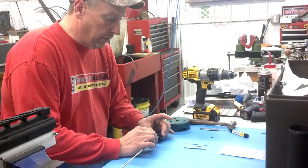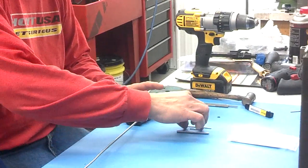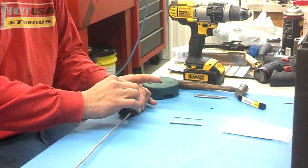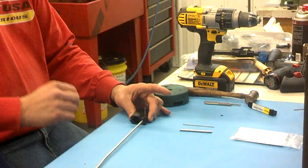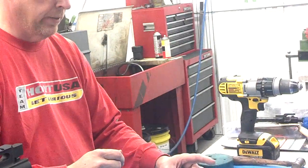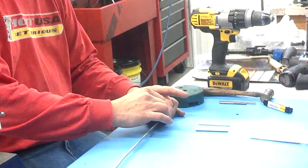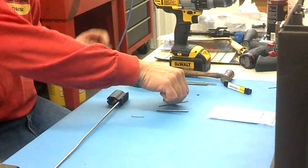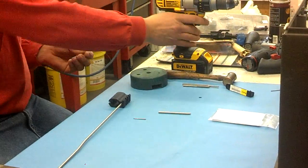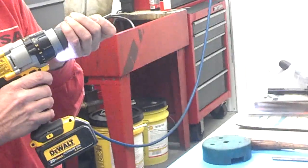The first step is to check the alignment of the gas tube. Try the alignment pin in there. Just like in about 90% of cases, your alignment pin isn't going to slide in there. So then you've got to take your chucking reamer, put it in a drill, and ream that hole open just a touch — basically reaming everything into alignment with each other.